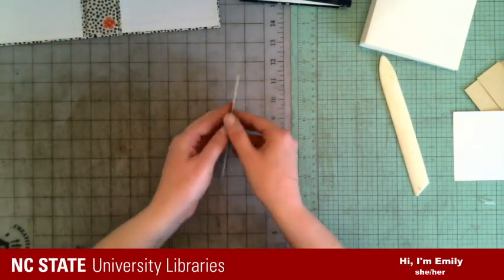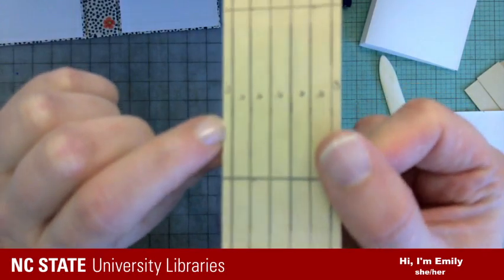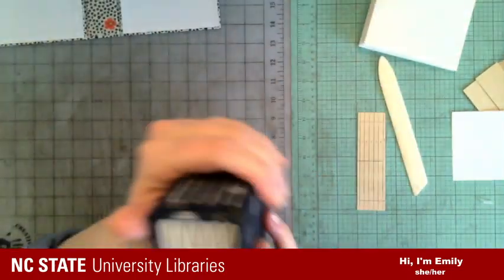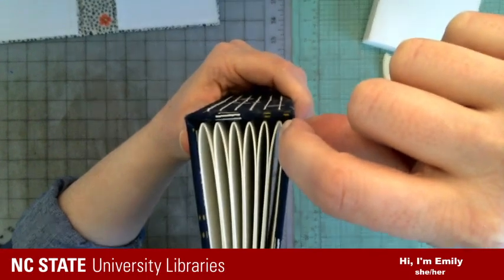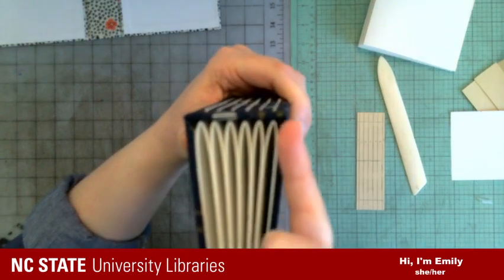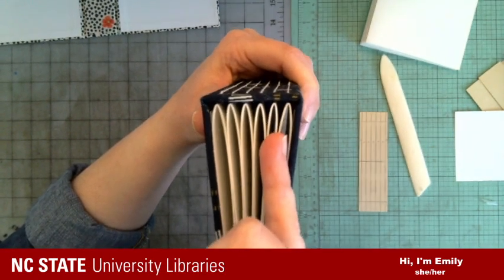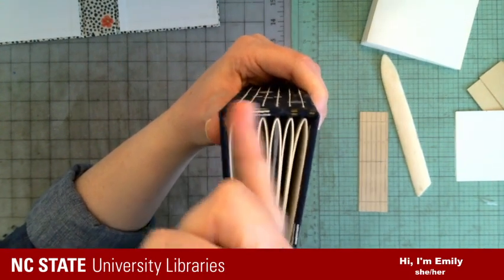You can see that on the edges I have 0.3, and then 0.6 throughout. I've got 0.3 on the outside edges — half of my section thickness — and then two halves belonging to separate sections in between. So I'm counting 0.3 on the edges and then 0.6 between each section in between here. I basically just took my ruler and measured those points, then drew connecting lines. I punched half an inch in from both ends and directly in the center.